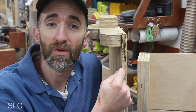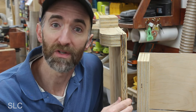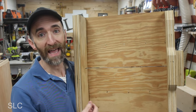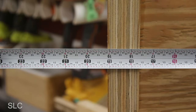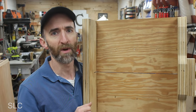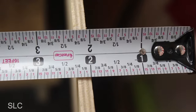Looking at these old versions, you can see that I used multiple layers of plywood for both of them, and I'm going to continue that process with the new sled. Plywood is good because it's less likely to warp and change shape over time. My new saw is a little bit larger than the old one — it has about 16 inches on the inside and about 19 inches front to back, so that's the size I'm going to stick with. For this build, I'm going to use 3/4-inch plywood because I already have it on hand, but you don't have to — you can use half inch or even quarter inch.